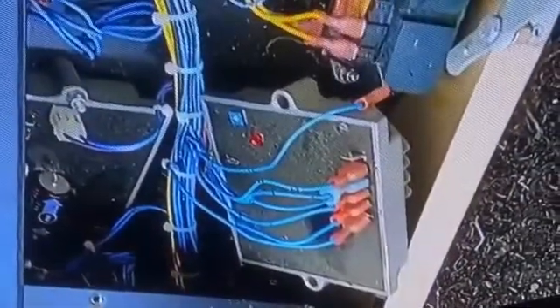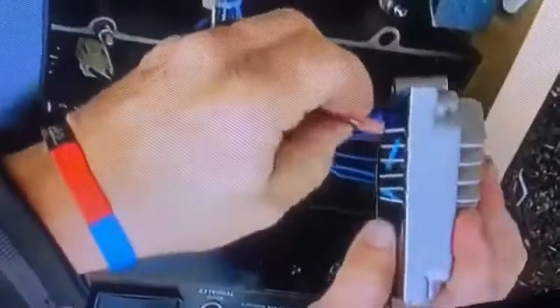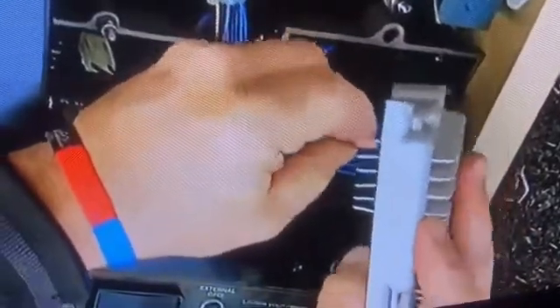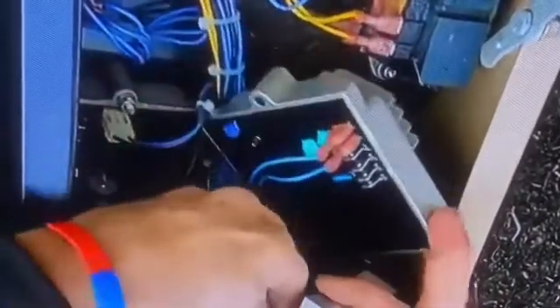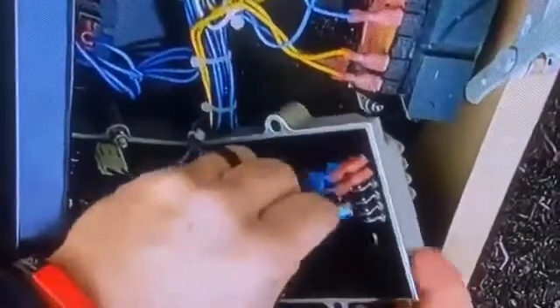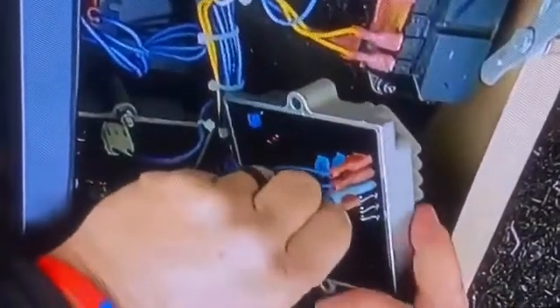Generally these come tuned all the way down, so you gotta make sure you adjust the voltage correctly. Then we'll check all the other things too — frequency and all that — because this is an old-fashioned one that has a mechanical governor that can get loose, and then the frequency gets out of whack. Things have changed quite a bit since this thing was built.